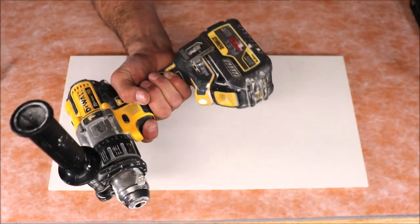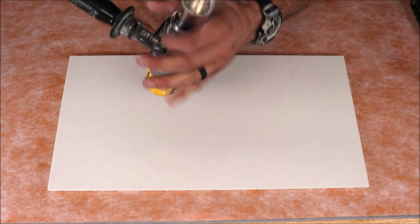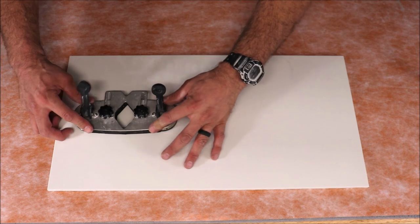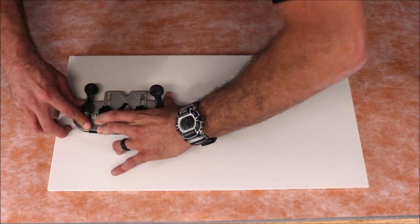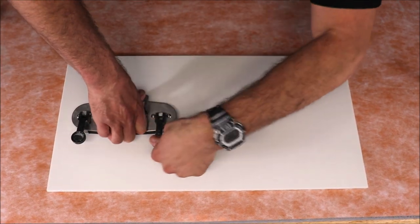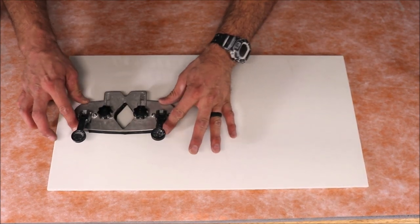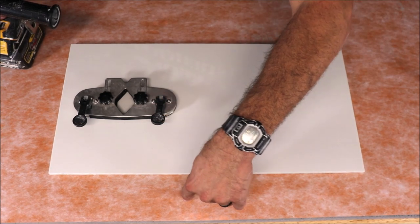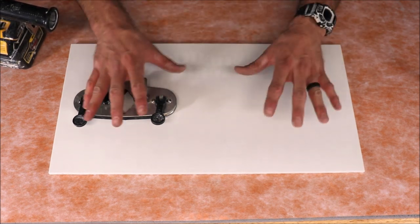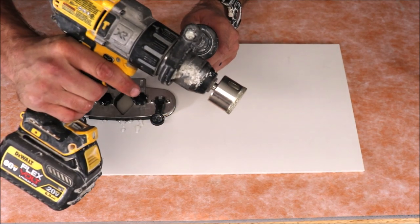You will need a drill. Attach like this, very simple. We first use this with the RTC stainless steel guide. Press down to get your suction. Loosen these up. Make sure it's sticking. Quick tip, guys, always use some sort of foam board underneath the tile to protect whatever is underneath the tile from damage. Add a little water and drill your hole.